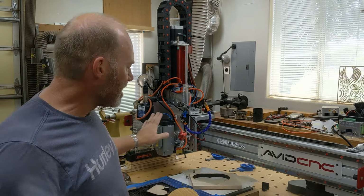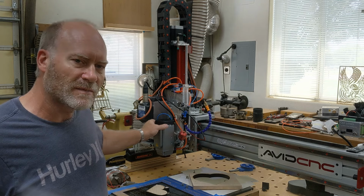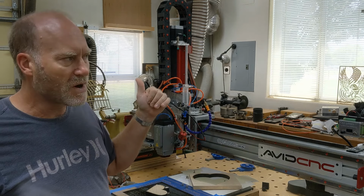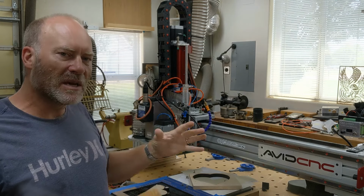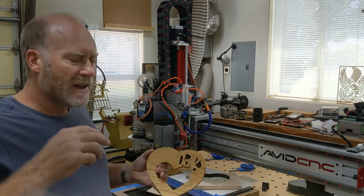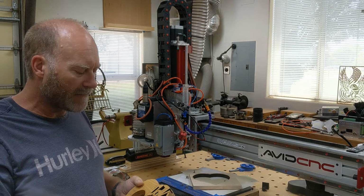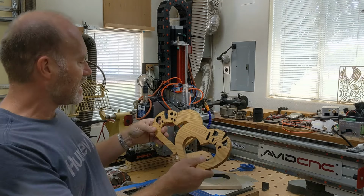So I know I can cut all the way through 3/4-inch oak with my 45-watt op laser, but just kind of barely, and it cuts very good quality for probably 1/2 inch thick, and that last 1/4 inch it struggles because the beam is spreading out. So what I really wanted to do with this is cut halfway through on each side and kind of meet in the middle. So that again requires me to get fairly well aligned. So that was the goal here, and it actually worked out very well.